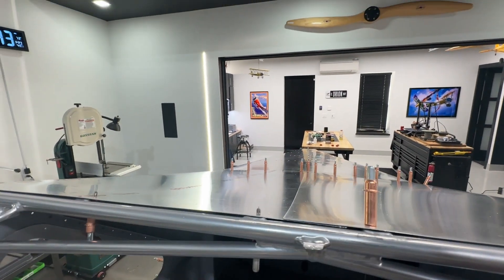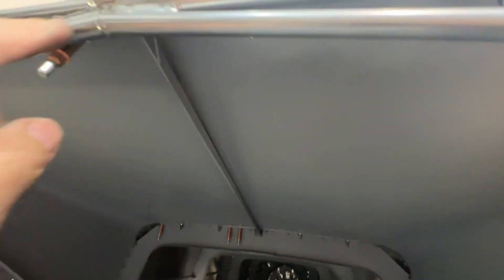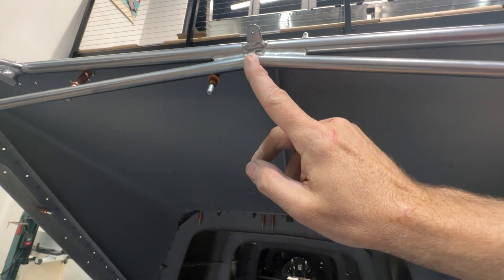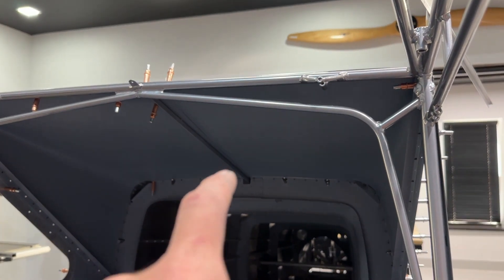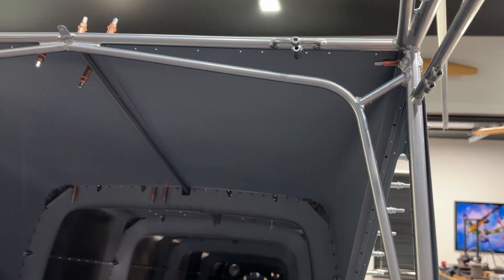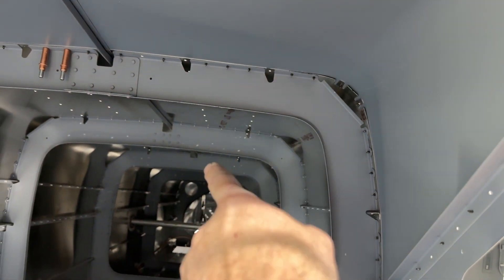Now I'm going to match drill through the stringer through both skins down the center seam. This position isn't really established yet, but this is the center of the frame, so I'll line up the holes of the stringer with this point, drill the first one, cleco it, and work my way down. Got all those drilled. Now I want to fish the stringer — the one that goes all the way down the tail cone — get that clecoed in place, do the other one down that side, and then do the short ones from station five through station four, ending up at station three.